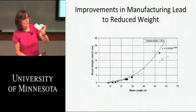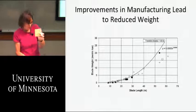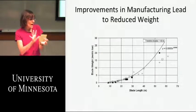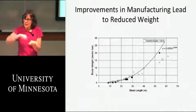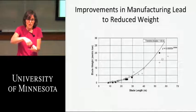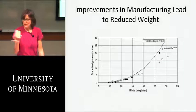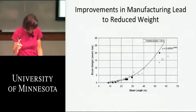The one that's a small square, when you get that, you'll see like a fabric weave in there. This one was made by taking a fabric and laying it down and then just, like one might do with a boat dock. So you've got some liquid resin and you're just painting down the layers. That's what was happening here. This probably has very low fiber volume fraction.